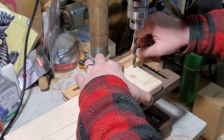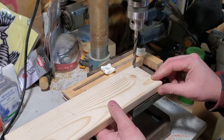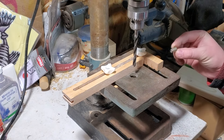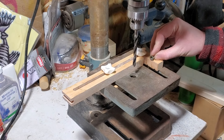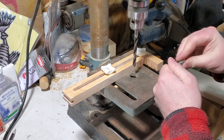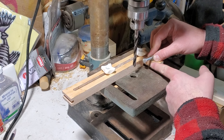So what I need to do, I have two options. One is I put a piece of scrap wood here in order to reference every time. The front to back is good, but it's the side to side that I don't have a reference. So I need to figure out something for here, and I think I've got just the solution. What I'm going to do is add a threaded insert into this piece here. I'll have a bolt — longer than this one, but I'm using this as an example — that's going to thread into the threaded insert and stick out, allowing me to bring the bolt in or out to make up the difference.